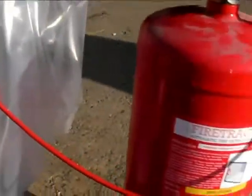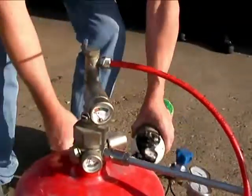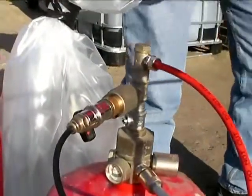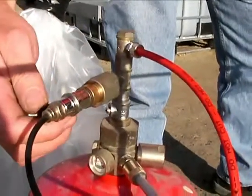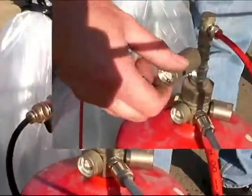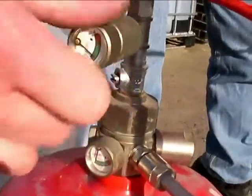This feature could be useful in the engine bay of heavy plant where a powder extinguisher is necessary to effect a quick knockdown and foam to prevent re-ignition. To arm the second system, it is merely necessary to pressurize the interconnecting tube and commission number two cylinder.